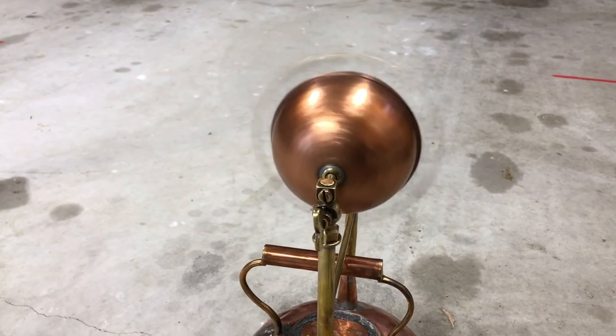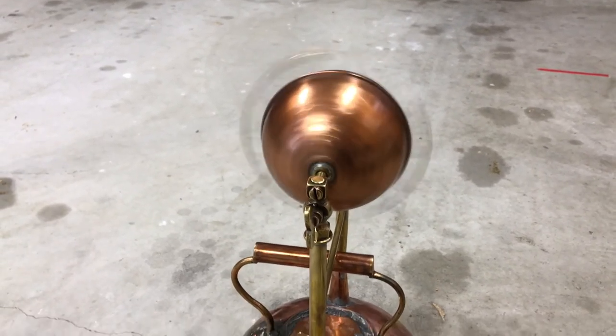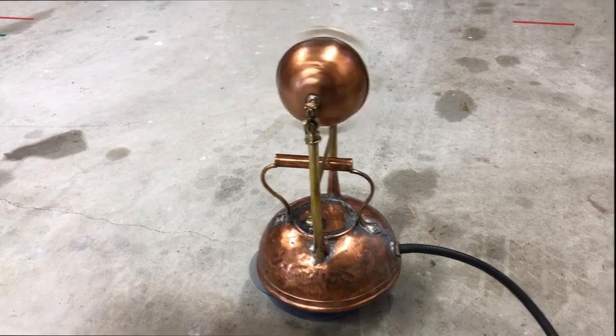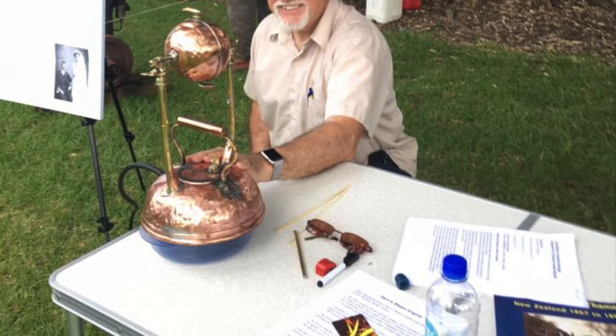You can see in the video frames how far the little jets have moved in a single frame, and from that you can calculate the RPM, which came out to 2,400 revolutions per minute. I also looked at the sound recording as a waveform and you could see the bumps each time it rotated around, and they were occurring at the same speed — 2,400 RPM.